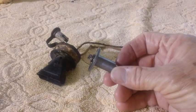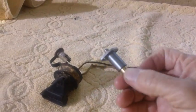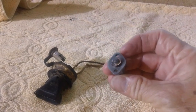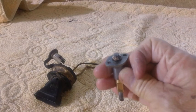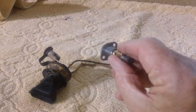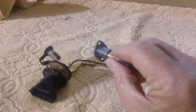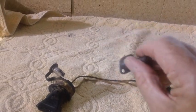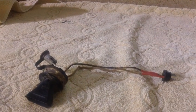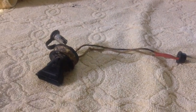I'll go ahead and place this on the radio and get this all screwed up. Remember, when you put the two screws through here, use brand new lock washers, okay? Don't use those old flattened out lock washers that came on the set. This is pretty important. You don't want it to be coming loose on you while you're adjusting the radio someday, tuning in the stations or whatnot. I think we'll go ahead and call this thing quits right here.